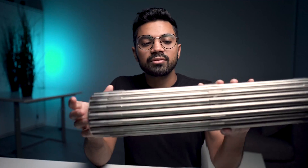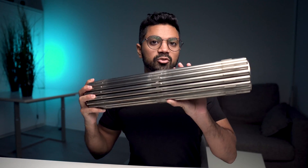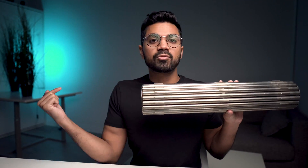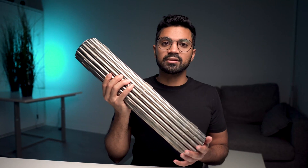Next I'll break down some of the essential components that make up this fuel bundle. Starting with the bearing pads — you'll see these raised pads on the surface, three sets of them on this bundle. These are really important because when the bundle is pushed into a pressure tube, it needs to slide in safely and also slide out when another bundle is pushed in. Another interesting part is the end support plates — the two plates at each end of the fuel bundle. These keep the bundle together and handle impact from adjacent bundles, ensuring separation between them. The fuel within the reactor is also sealed very, very well, acting almost like a containment system within the reactor core.